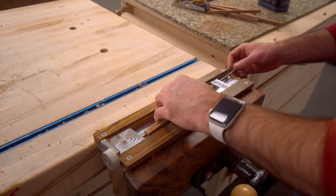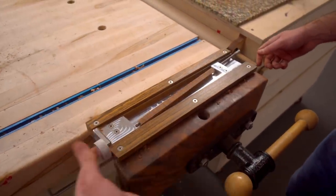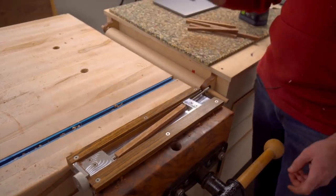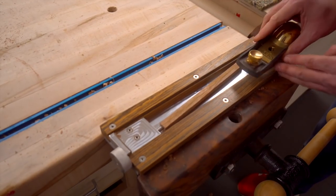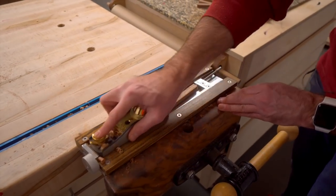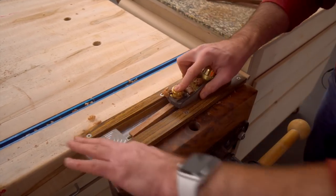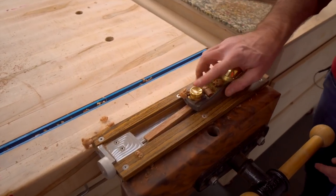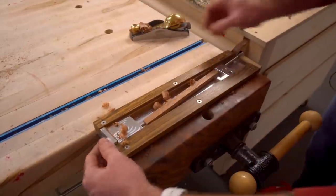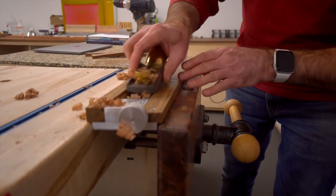So we'll go this way and that fits over top of there, and then this side clamps down on that. This has positive stops. So now you take your block plane and it runs along this groove right here, butts up against that wall, and then you just run that right over top of that. It does have a little bit of rubber padding on here so you're not going to hurt your block plane. Once you get a plane, you can then take that, rotate it one notch. The plane will bottom out once it gets so far and that's when you know you're done.